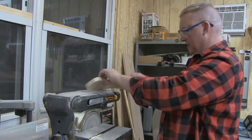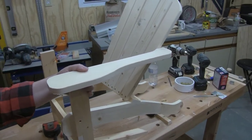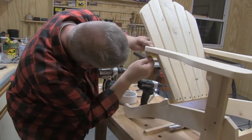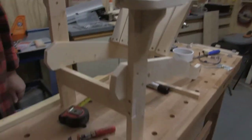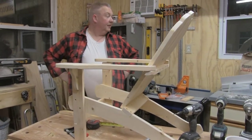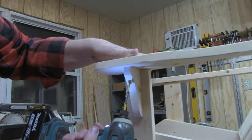The good old shop sander — that tool has been proving very, very good, a real time saver. We'll get the screws put in. It's really starting to come together at this point, really starting to look like something. Now I'm just checking out what length we're going to need for the slats that make up the seat. I'll be getting on the table saw to get some of that work done, then get the arms fitted more securely using a longer screw, going in underneath using the corbel I've made to hold those nicely.